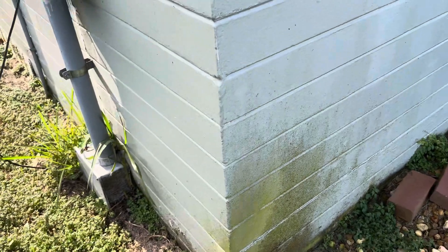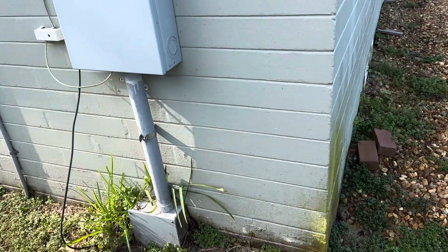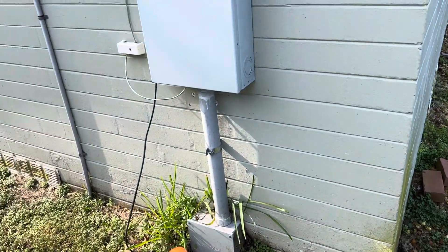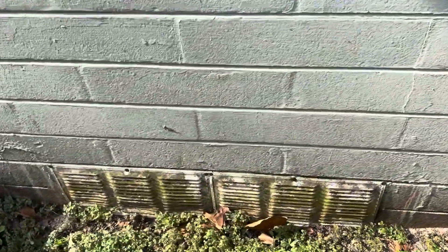You can see your molds that have set up here — see that bright green? That's just mold, and that's because of the moisture. We've made note of all the compromised areas: we have split block, paint failure, a bunch of things. Check out this vent down here — this is a dirty vent. Make note of this because in the next video you're going to see that thing turn bright white.